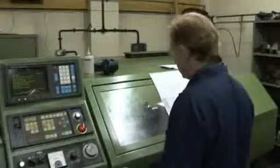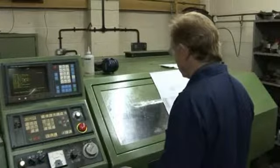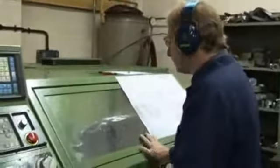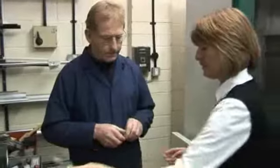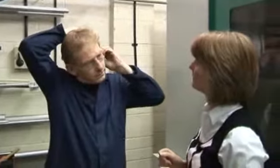Hearing protection should not be considered as a long-term solution to protecting workers from noise exposure. The reason for this statement is twofold. Firstly, the performance of hearing protection is very dependent upon the fit and condition of the protection. Incorrect fitting of earplugs, for example, can reduce their performance by as much as 22 decibels. It's essential, therefore, that instruction is given before use.